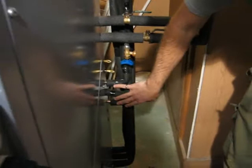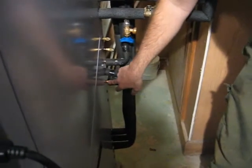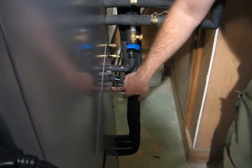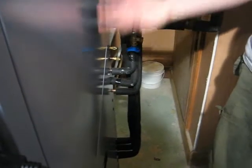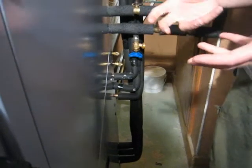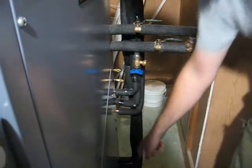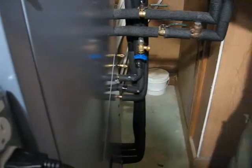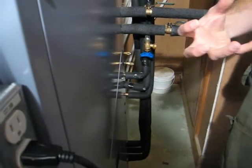We have four pipes that go in and four pipes that come out. The pipes that go in are usually a thicker gauge. What comes in is vapor — the vapor is compressed and it gets hot, basic thermodynamics. It runs over a large heat exchanger, which I'll show in another video. Then the compressed liquid refrigerant comes out and goes underground a hundred feet down, where it goes into the wider aperture copper pipe again, expands, and sucks heat out of the ground.